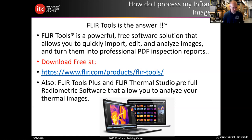Michael asks: where do you use an infrared camera in a house? Everywhere you're looking. Ben would look where there's a potential moisture intrusion issue on the inside, home energy deficiency areas, and anything that might be hot like an electrical device or switch. Bill agrees — as property inspectors, do a quick scan when you remove the electrical panel cover to see if something is overheating at a breaker or neutral wire. Always look underneath shower pans, underneath cabinets, scan floors in front of refrigerators, and scan the wall behind them — all potential areas of water intrusion.